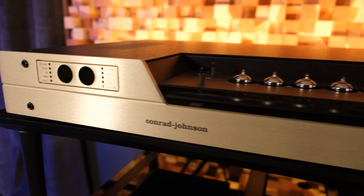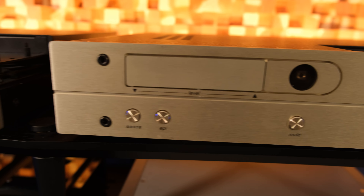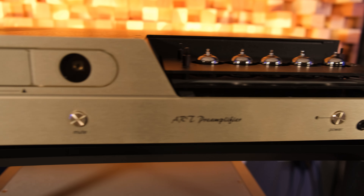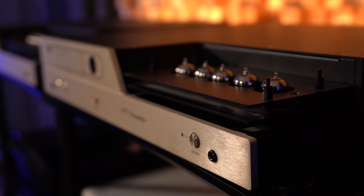Composite triode is a cool approach. It's one of the reasons this preamplifier sounds like nothing except the attached equipment and the music flowing through it. Each 6922 is a dual triode, so it has two triode sections available. Conrad Johnson wires five of these in parallel, meaning that ten triode sections are acting as one tube. In most tube circuits the tube handles the voltage gain and then there's another circuit — generally called a buffer — which handles the current gain. But in the Conrad Johnson's ten-triode approach, that extra stage is not necessary.